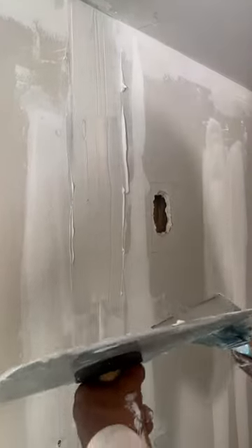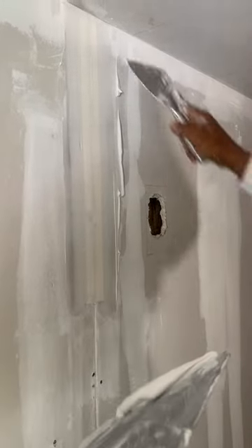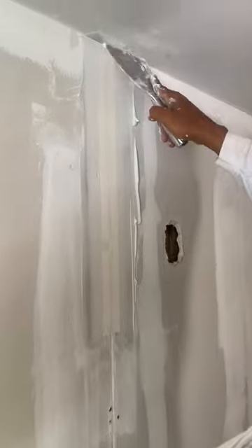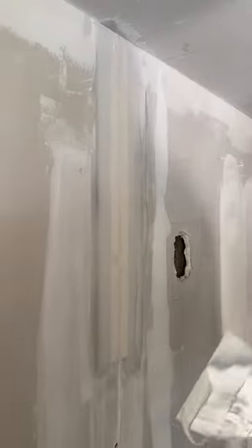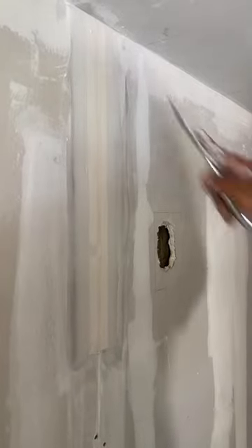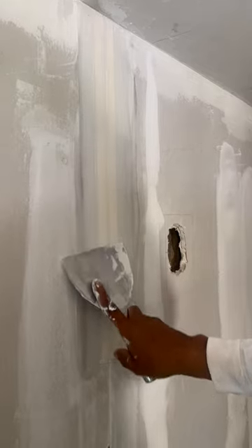You want to wet it, then you come back and take it off pretty much. You're wetting it — or you're embedding it. Also feathering. Look, I'm applying pressure to the side. I'm taking off my mud in order to prevent sanding. Look, I'm applying pressure over here to the left side.